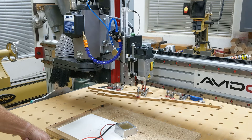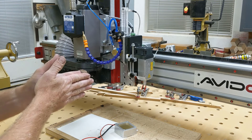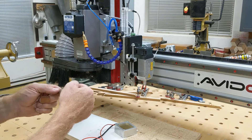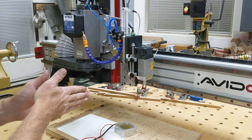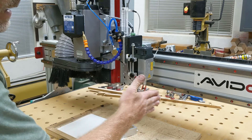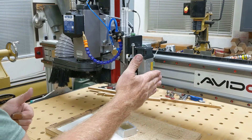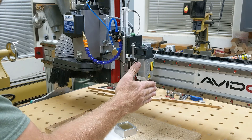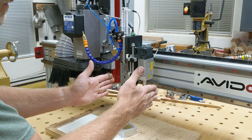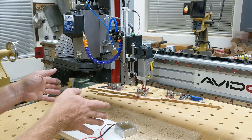The ESS plugin recently enabled picture rastering, and in that process one thing I learned is that the software only lets you raster in the X-axis. You want your laser beam — which is not symmetrical on a diode laser — oriented correctly. In my case it's eight thousandths of an inch in one direction and two thousandths in the other. You want that long axis going perpendicular to the direction of rastering. You get the nicest symmetrical pixels that way because the laser fires at the beginning and end of each pixel, giving you the most symmetrical window without that extra wide piece on each end.